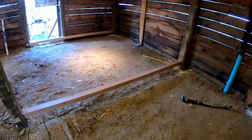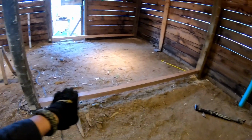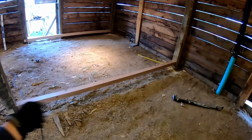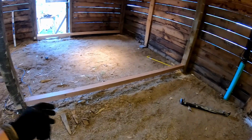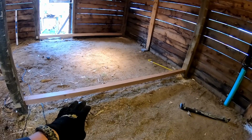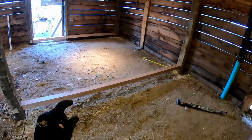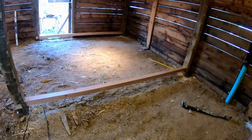The reason we're doing it after is because we've ensured that the bow of this is down, and then we're going to run a line on the board and then use a string line to level up the girder. And so that will compress the mini posts against the foundation stones and get everything tightened up. And then we'll anchor those